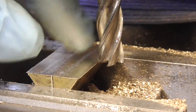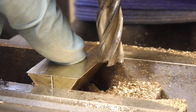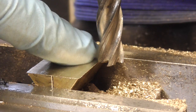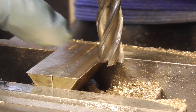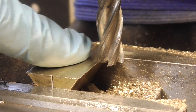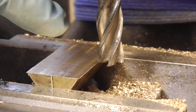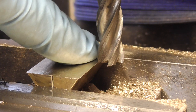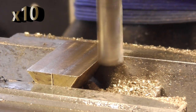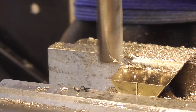I've centred my tooling on the part and I'm going to run in the 10mm slot, then I'm going to measure it just to see, because we do need exactly 10mm plus a bit of wiggle room. I need that 2.2mm deep - 2mm is the thickness of the bar, I'm going to add about 0.2mm, just add a little bit of wiggle room, don't want to go in too tight. I'm going to run a couple of passes.